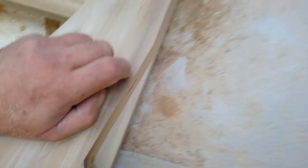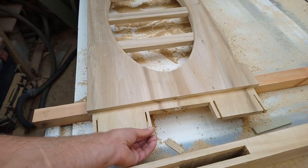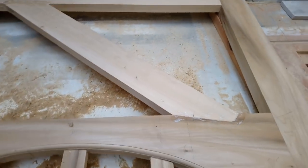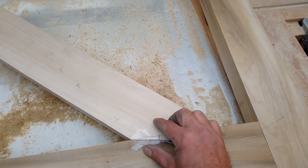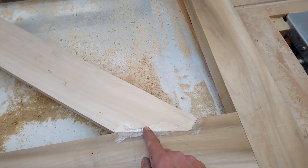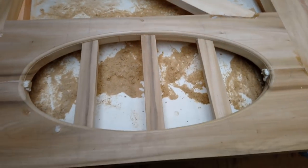I'll put a domino in there for the base, one in each end of these, and I've cut down these wedges. Right, it got glued up, came together okay. Struggled a little bit to get these absolutely tight. I don't know why. Normally I'd put a biscuit in there, which allows for a bit of movement. One of the dominoes I did cut with the wider cut, but it's only a millimetre or two off. But it was perfect when I set it up dry, so don't know.